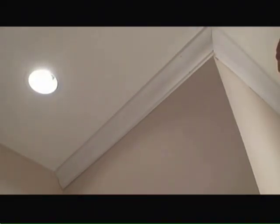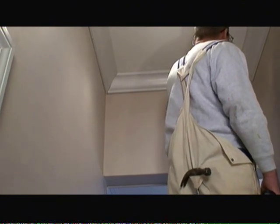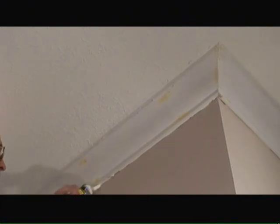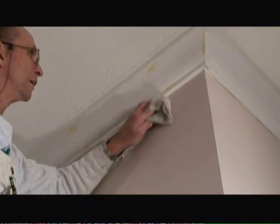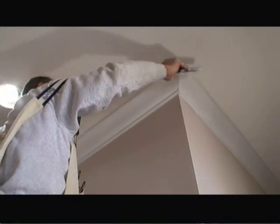Now that we've completed the first section of crown molding, we'll move on to the next portion. One of the most difficult sections to install is the double-edged coped cut. Once you fasten the crown molding to the walls and ceiling, you need to fill in the nail holes and seams with wood filler. For the edges, apply a silicone caulk along the wall and the bottom edge of the crown molding and along the ceiling and the top of the crown molding. After applying a bead of caulk, use a wet rag to clean up the seam. Then just touch up the crown molding with a little paint and your crown molding project is done.